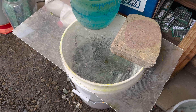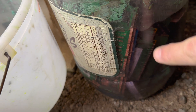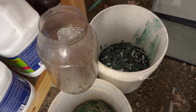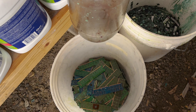You can see the acid is kind of coating the rim right here. Over here is another bin filled with recycled acids. The fun part is the copper and the tin switch places — or it could be a different metal — but the copper chloride goes from a nice dark color and then it turns into what I'm thinking is more of a stannous chloride. You can see the copper has started to cement out onto everything metal. It effectively takes the chips off, which is really cool, but I don't know how to recover the stannous chloride to get the tin back and allow it to go back into a copper chloride. The fresh hydrochloric is what I'm going to use to take those fingers off.